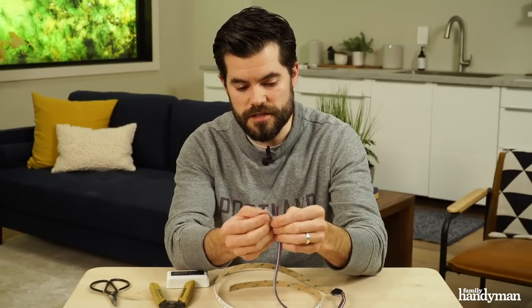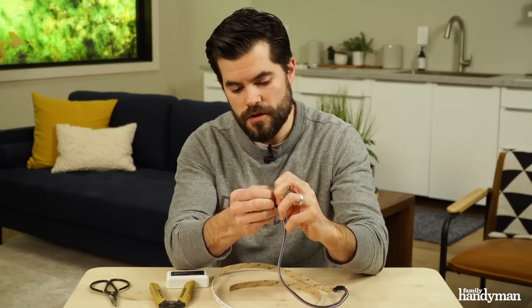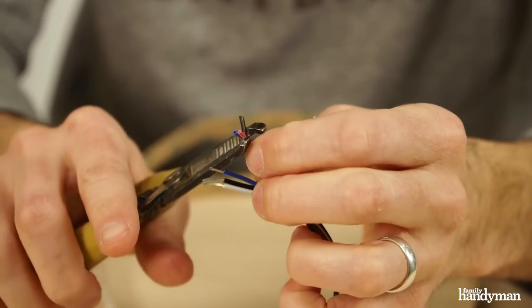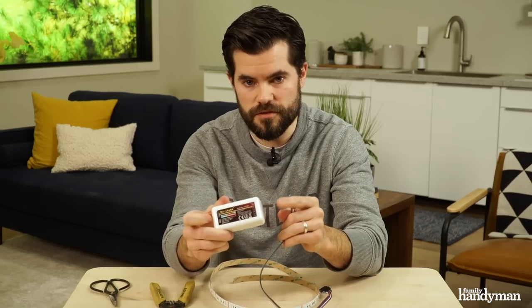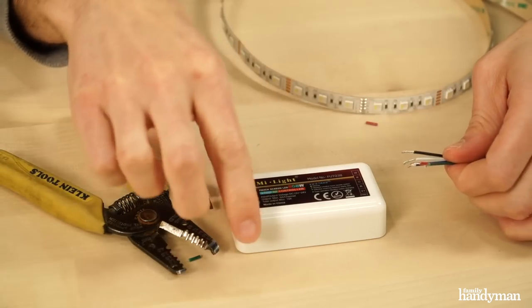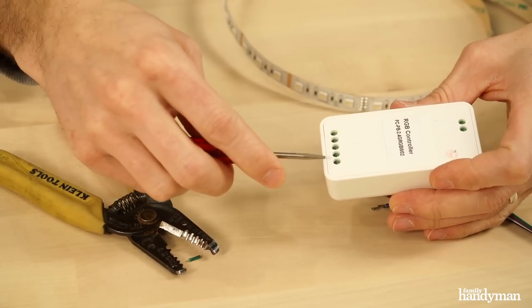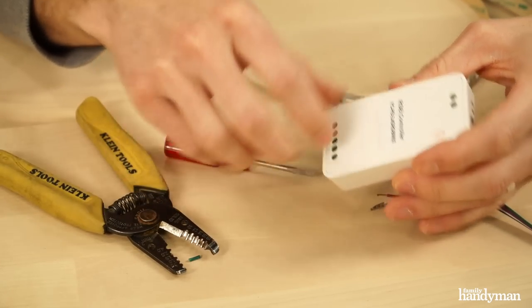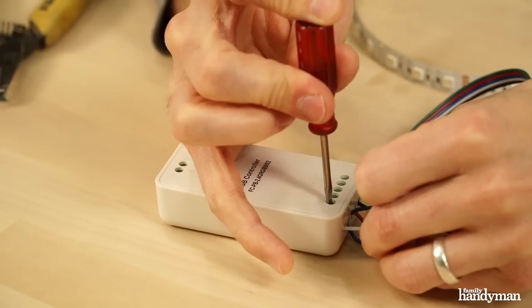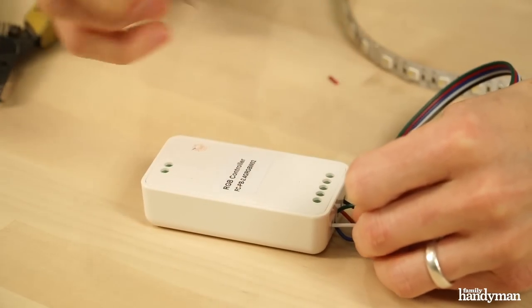It may not be in the same order as on the cable, so you might have to do some rearranging. Now do the same thing with the other side of the wire — peel these wires away. You are going to have to strip these down a little bit so that they make the connection into the controller. Then to get the wires into the controller, flip it around, loosen all of the set screws, and match up the color wire with the corresponding letter into the controller and tighten the connection.